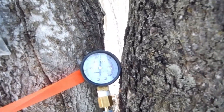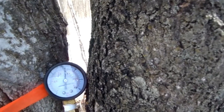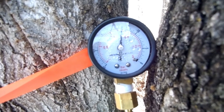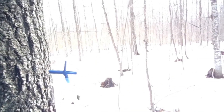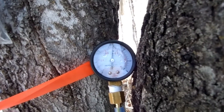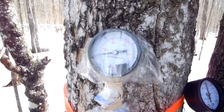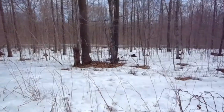The gauge had a reading of 28 inches, which would have been nice but seems too unrealistic. We installed a second gauge that we know is working well, and that one reads about 14 inches, which is what we'd expect right now. We haven't turned on any vacuum yet. We have a dairy vacuum assist that probably has 7 to 8 pounds, so when we turn that on we may go from 14 to around 22 inches. The first gauge reading of 28 to 29 inches suggests something may be wrong with it.